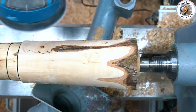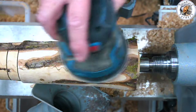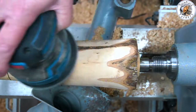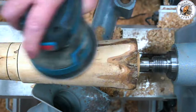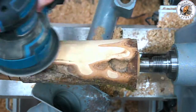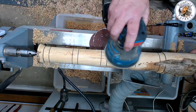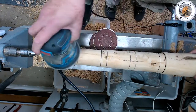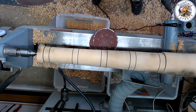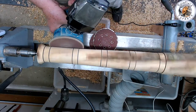Because of the inclusions and indents in the shaft there are a few places where there's been a little pluck in the cut which didn't look very good. I didn't want to rub it out by hand so for the first time ever I've used this random orbital round sander, and that's actually proved to be very effective. I think I'll consider using that again in combination with the normal rotary system. I started with it stationary for the smoother part of the shaft, then spun the lathe up at 200 or 300 RPM and it ran around it very nicely — another tool in my arsenal I never thought of using before.